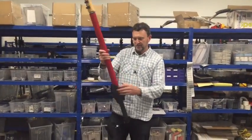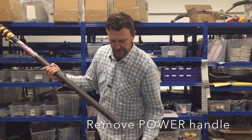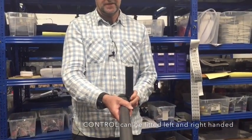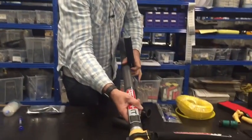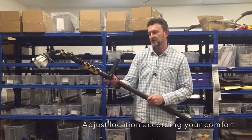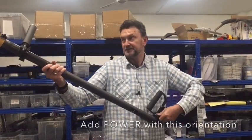To get the control handle on, we actually have to undo the pole skin. So take the pole skin off and also take the power handle off. I'm actually left-handed, so I would fit the control handle this way, but because most of you are right-handed you'll want to fit it that way. Put it on there and slide it on — it's a little bit fiddly, you've got to open the clamp a lot. Remember that lever needs to be wide open for the clamp to be wide open. Then slide it over the sticker and adjust it to where you want it — you might be short and want it down low, or tall and want it up higher. Then put the power handle back on, clip it onto the end, do it up tight.